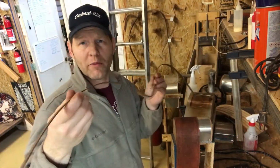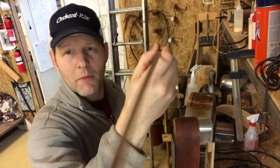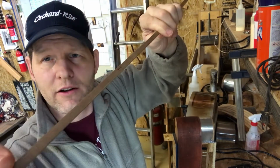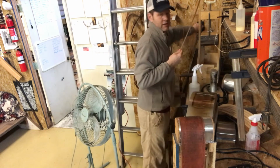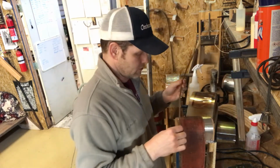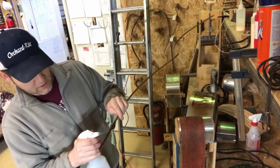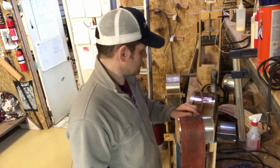Okay, so here I am over at the bending station with this harp arm piece of binding. And I put a little mark on it, right there, a little arrow. From that little mark this way needs to be bent. And so I bend it on this cutaway bending jig. So I turn on this flashing red, yellow, green, blue light over here, which keeps this circuit on a timer so we don't burn the shop down with the heat blankets. Many a luthier shop have gone up in smoke from these bending jigs and heat blankets.